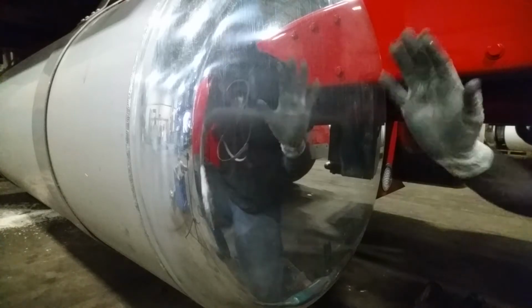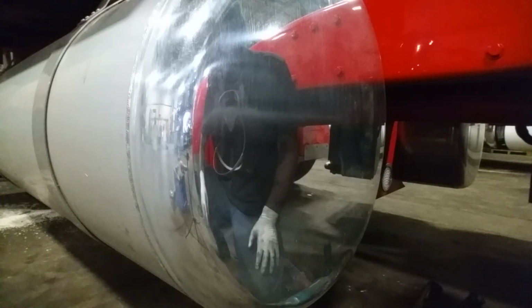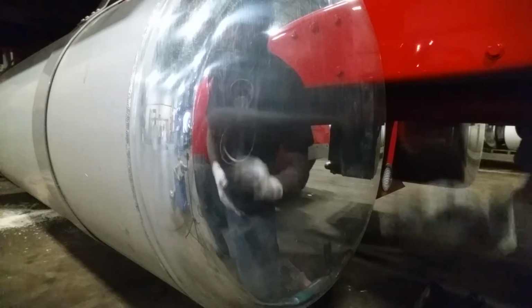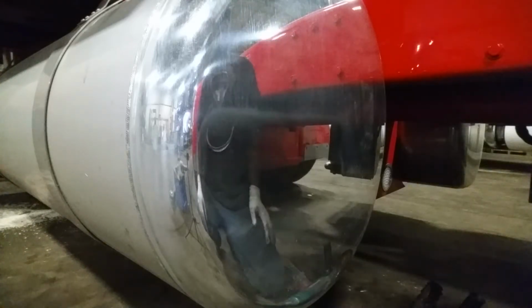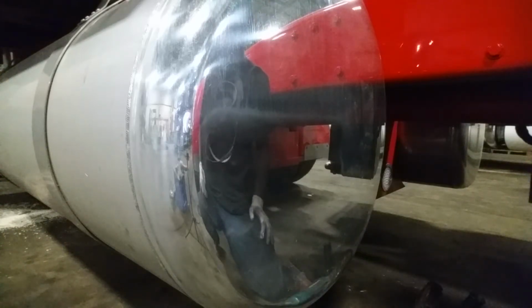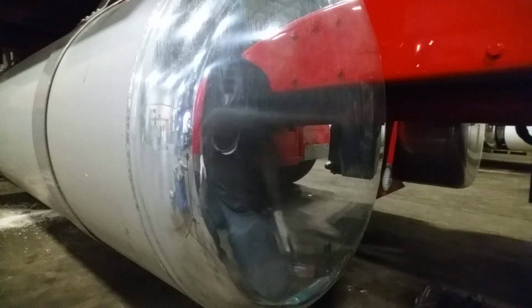and it really shows up a lot after you polish. So you may want to start out with a 600 grit sandpaper to see if that takes it out. If it doesn't, move down to the grit that will take out the scratch, and then work yourself up 100 grits at a time to remove the sanding marks back up to 600. And then you can start polishing with the Keystone Brown, and you'll have excellent results.